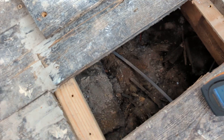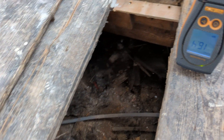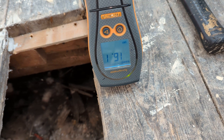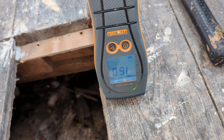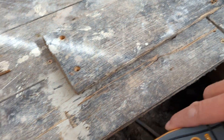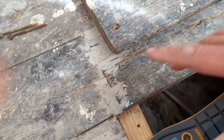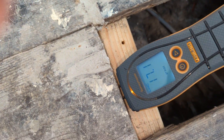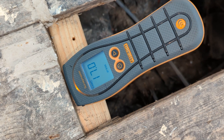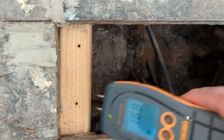The purpose of this video: I've often talked about the moisture content on the upper surfaces of the floors. I'm going to put my moisture meter in there and we've got a moisture content of sixteen point one percent. On average, sixteen point one percent. Now I'll put it slightly further down on the floorboard and we're getting a slightly increased reading of seventeen point one percent moisture content.